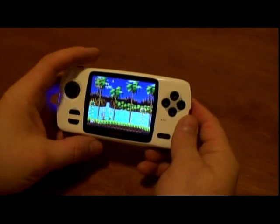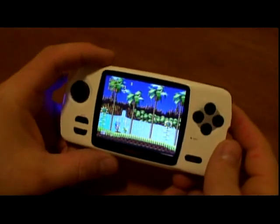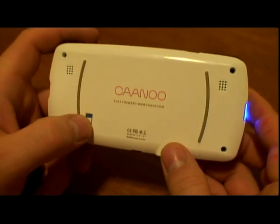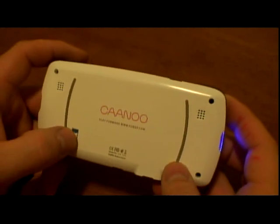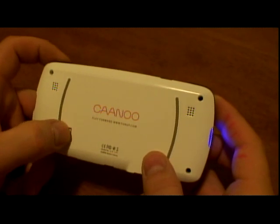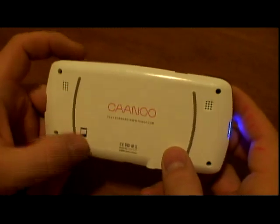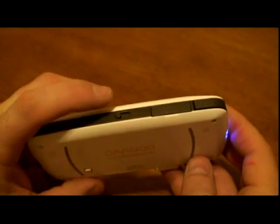What I did — because like I said it's still a little bit too loud — I modified it. If you flip the system on the back you can see a switch right here. I put that switch to control the two speakers. I added a couple resistors, and that's pretty much it. It works like a high and low gear — the volume controller still works, but that's a different max level.